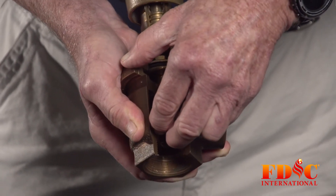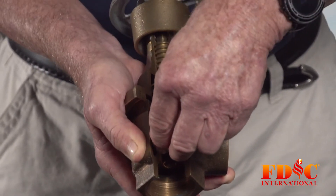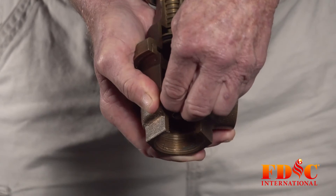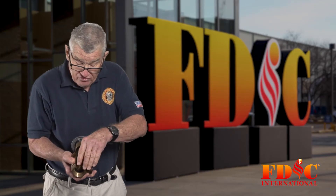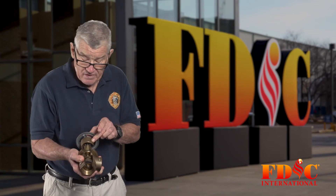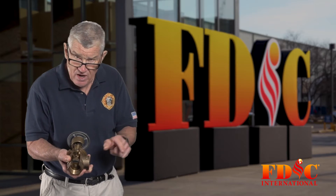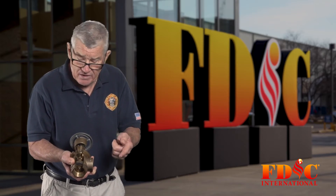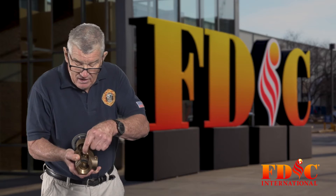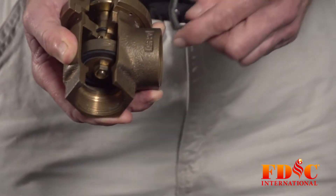The valve throttles itself from being completely closed or completely open in response to changes in the downstream pressure. For instance, the valve may appear to be open — there may even be an indicator that says open — but the valve is actually closed and will remain closed until there is a reduction in downstream pressure. If a sprinkler head is activated and flowing, that reduction in pressure allows the plunger to rise either completely open or at least partially open.